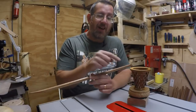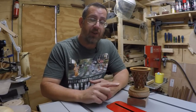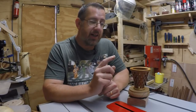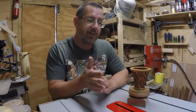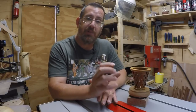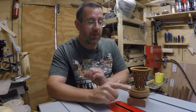No finials — that was the original plan. I have thoroughly enjoyed every part of this. I think it threw off the lathe probably about three times and not one little bit of damage. I didn't actually start getting catches until I started trying to shape this top ring. I think the reason was my new Ashley Isles 9mm spindle gouge — I've got such an acute angle on there that I don't think I was riding the bevel properly and it just literally dug straight into the wood. You could see big gouges where I got a catch. There was such a small mortise on the bottom — only about two or three mils being held in by the jaws — so it had no chance and threw off the lathe every time. Each time it did that it damaged the bottom, so that's why I ended up having to part the bottom off.